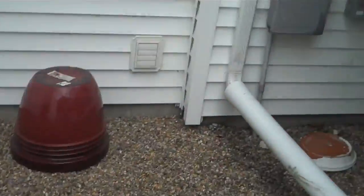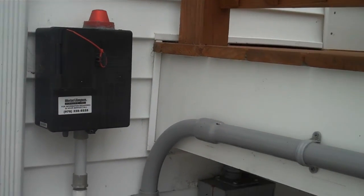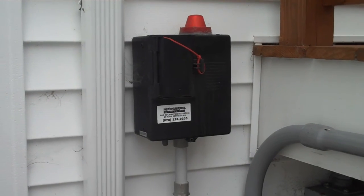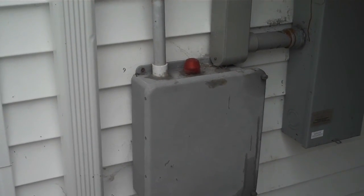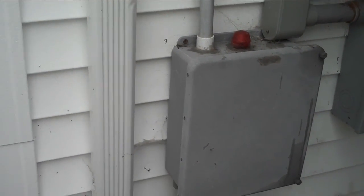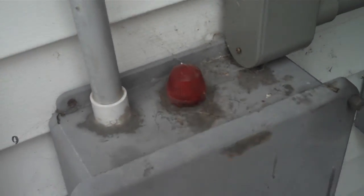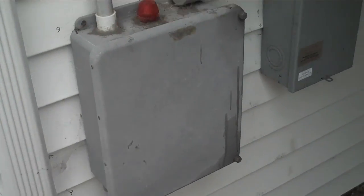Let's take a look over at your panel. Diane's system went in quite a long time ago — it might have been 1998. This is one of the older systems. She's got the battery backup, and I'm going to guess that this battery backup is not functional. If it is functional, then when the water hits the alarm level, this light will actually go on. But any system that's this old, I do not expect the battery backup to be working.